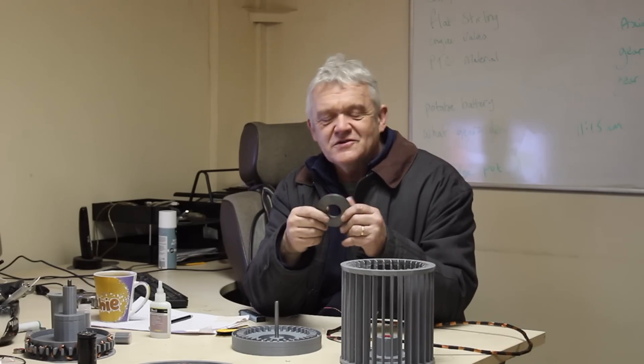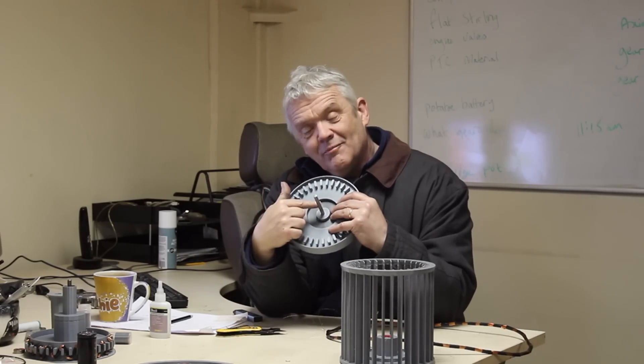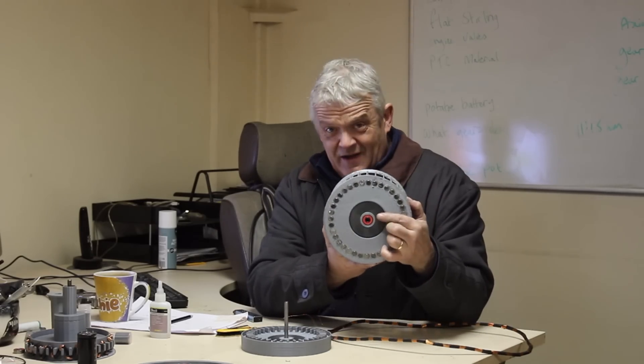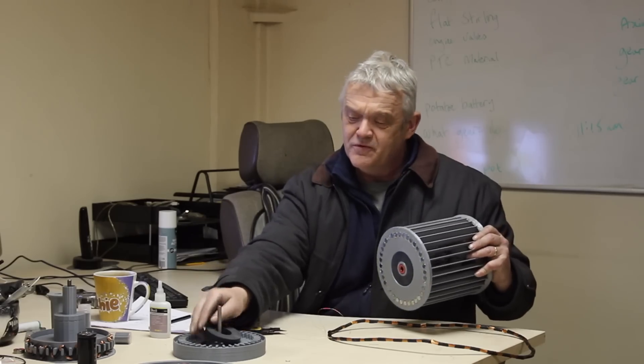You need to buy some ceramic ring magnets — I got mine from Amazon. They're 10 millimeters thick, 72 millimeters outside diameter, 32 millimeters inside diameter, and they drop nicely into that space. The bar is 8 millimeters thick — just a bit of steel bar from the local B&Q. You need two of those magnets: one goes in each recess, and you need to point them north-facing-north. If they're pulling together, swap them around until they push apart.